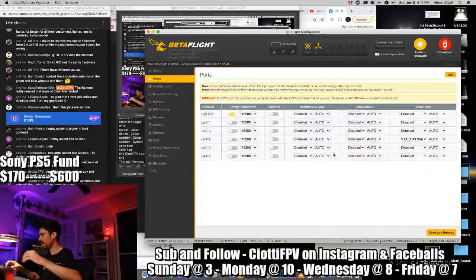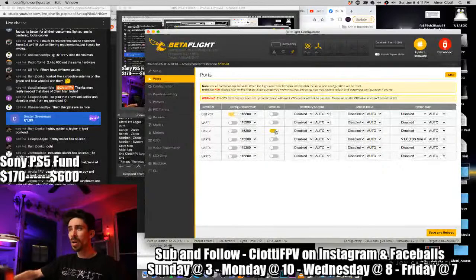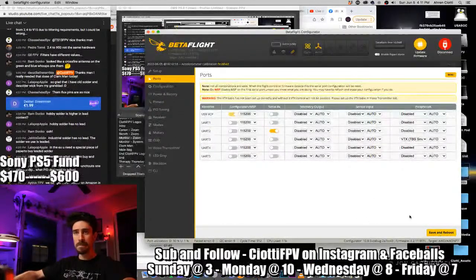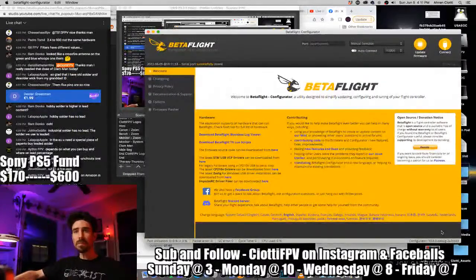Yep, I can see it there. It's on UART 2. So UART 2, we're going to click the Serial RX here. IDV says TBS. Jack Lanois says TBS as well. Cool. Save and reboot. John Goblin says it uses Smart Audio.